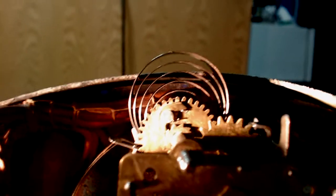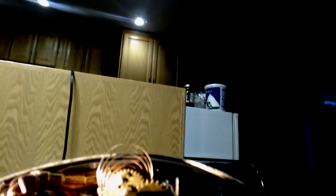First of all, we're gonna talk about the main gear system and the alarm. If you see right there, how that thing has this little tooth right there and then the second set of teeth. When I crank it up, you'll see how that kind of acts there. It's the same thing for the other crank. You see down there - this twists up, and that tooth allows it to go separately. But when the alarm is ringing, that tooth gets stuck, so it doesn't just allow the wind to free spin.